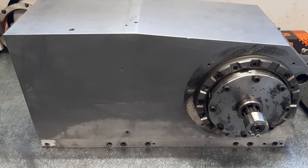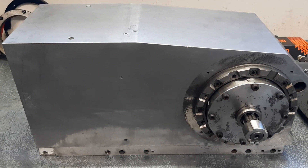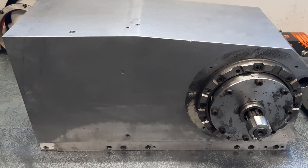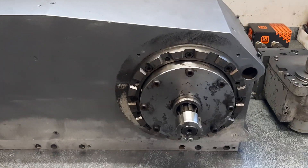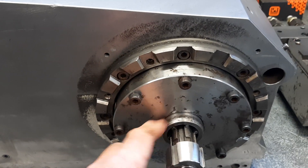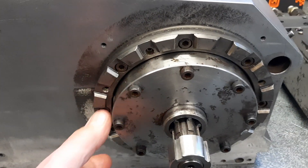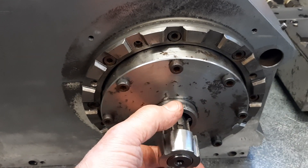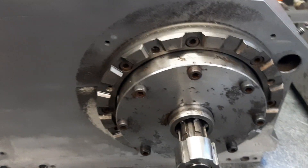As I mentioned before, if you're following along, I had this whole housing hot tank just to clean it all up. And then I've gone over and stoned all the surfaces to take all the nicks and burrs out of it and make it a bit more appealing to look at. The next thing I'll probably just take you down to show you is the hydraulic piston or cylinder - I referred to it as a drum in the previous video. That unit drives the actual tool turret out so it can index into position.